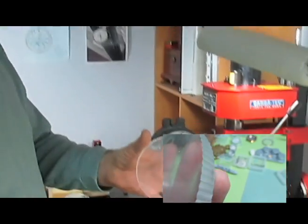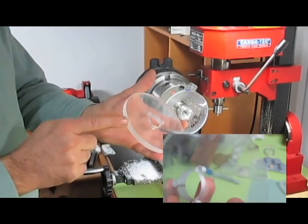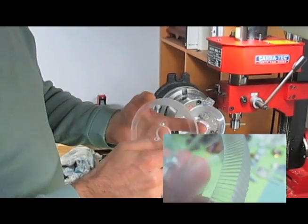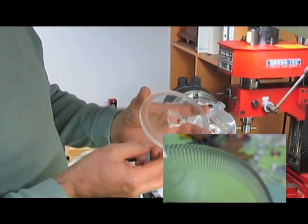It's just like glass, and hopefully that will work for the rose engine which I'm making now. I would like to show you how I cut those waves, different waves on rosettes. You can see that this one here has 96 bumps — 96 waves around a rosette. This one has 200 here and 200 on the face here, 200 waves for pumping action.